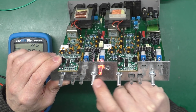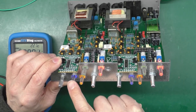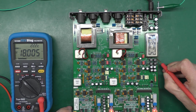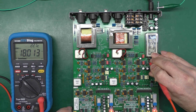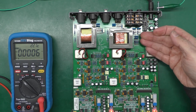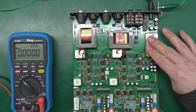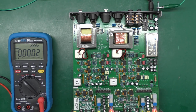Let me cycle the power off and on again — given what happened last time, I want to be sure. Back on: minus 18 volts, rock steady; plus 18 volts, rock steady. The DC-to-DC converter is getting warm but certainly not hot — warm is expected. There is an optional heatsink available for these DC-to-DC converters, but I think the designers were quite correct not to fit one — it only warrants getting warm. Looking good; I'll box it all up and do a final power-up.